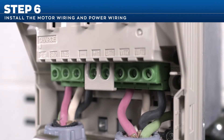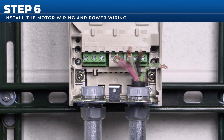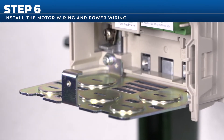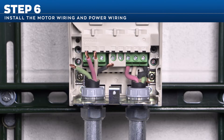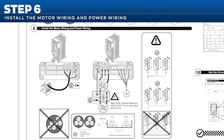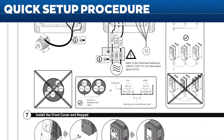In step 6, install the motor wiring and power wiring. Once all power is deactivated and locked out, connect the motor ground to the drive's ground terminal. Then wire the drive output terminals U-T1, V-T2, and W-T3 to the motor. Be sure to separate line power wires from motor wiring using conduit or cable tray dividers. Connect the incoming supply wires to drive input terminals R-L1, S-L2, and T-L3. Don't forget to connect the incoming ground source. Note: if installing multiple drives, follow the grounding graphic shown. Once you've completed and verified all of the wiring connections, continue to step 7.